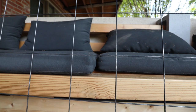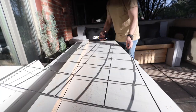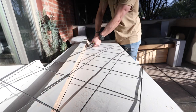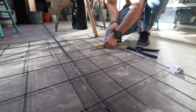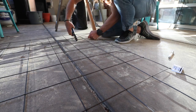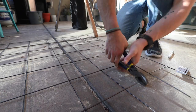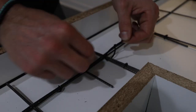In order to make the countertop even more durable I'm going to add some steel wire remesh to the concrete within the mold. So I used some pliers to cut down a couple pieces to the shape of the mold. Be sure to leave some space at the ends — you don't want this going completely to the edges of the mold walls. I found that using a silver marker really helped me locate where to cut. I dry fitted these pieces and then attached them using some zip ties.